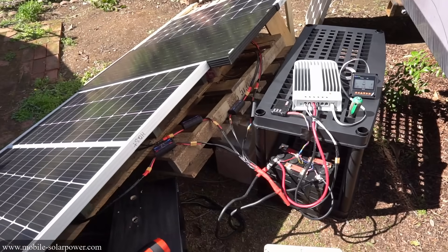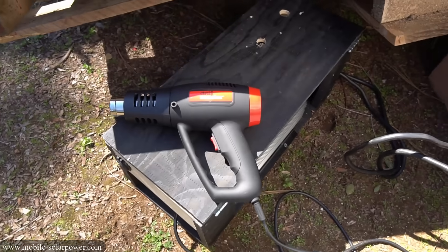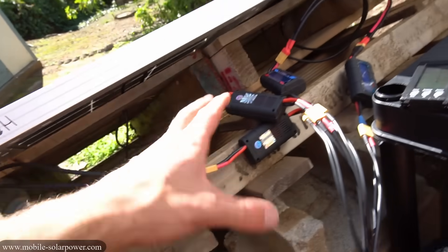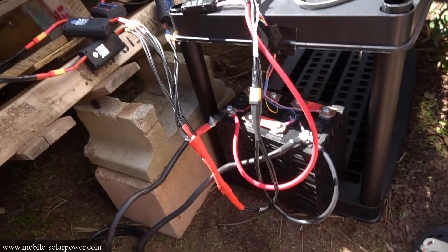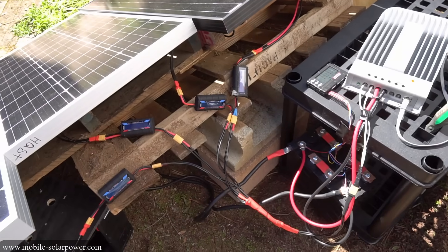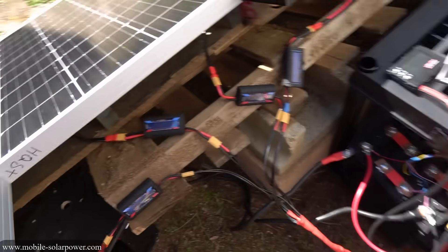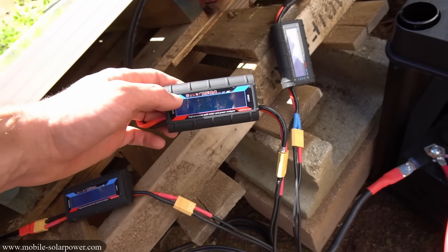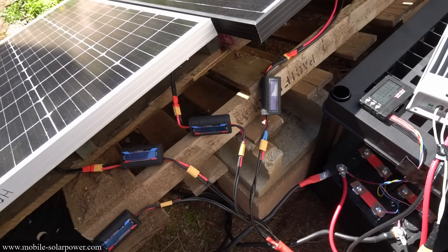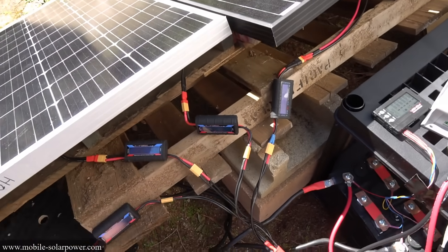This is how we're going to test the output of these solar panels. I have a lithium iron phosphate battery with a 40 amp MPPT. I also have a cell balancer to check the balance while charging. We have a load for the battery. The panels have the same ventilation underneath, the same gauge and length of wire — all oxygen-free copper with the highest quality components possible. Each panel will have a wattmeter connected between it and the MPPT, since testing with resistive loads didn't allow nearly as much power as connecting directly to the MPPT.